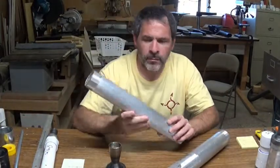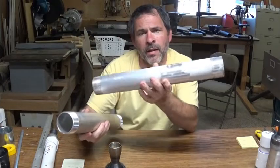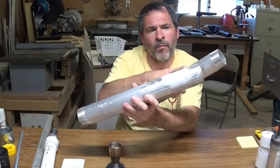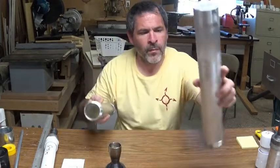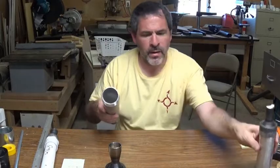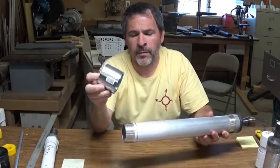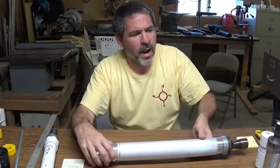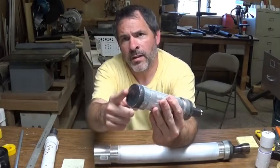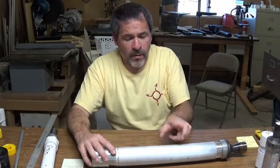What we are going to do is rebuild. I've purchased a 16-inch aluminum pipe nipple, the same as before except this was an 18-inch that we cut the threads off one end of so we could weld in the bulkhead. We're not going to do that style again. Instead, we're going to duplicate the same idea we use on the Robo Monkey — steel nozzle on one end, a steel coupling on the other end, cut that down to size, and make a steel bulkhead that threads onto the end. On the next ground test, this will have five fuel cells inside instead of the one single fuel cell. Let's go ahead and build that, and then we'll test it.